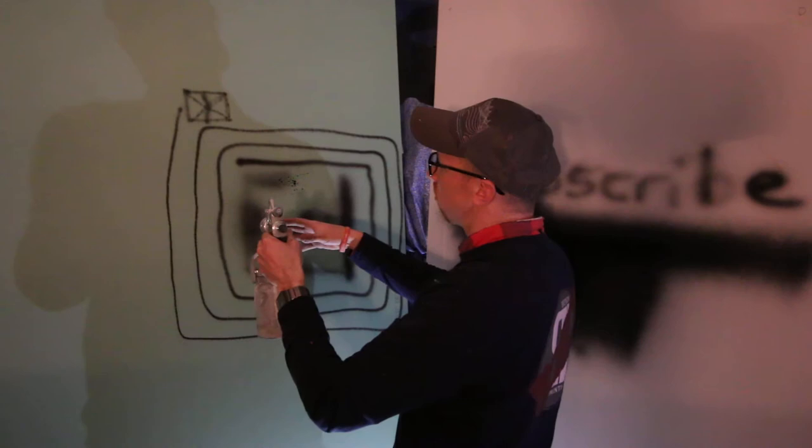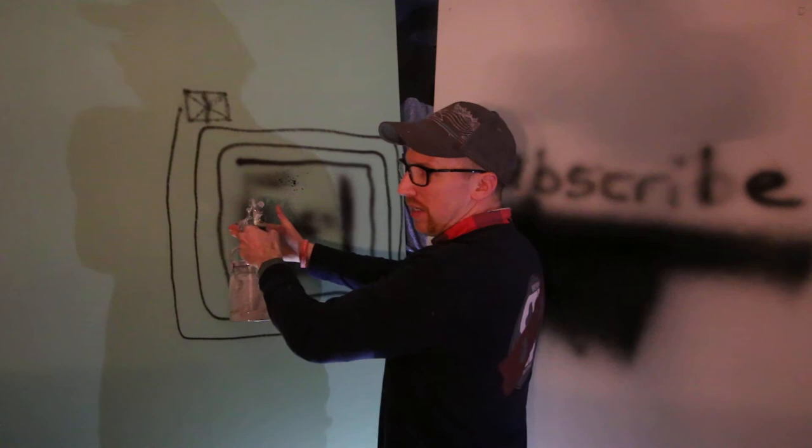And also, instead of that 6 to 12 inch radius that you're working from, you're going to want to be anywhere from 1 to 9 inches with your HVLP. Typically you're about 6 inches when you're running one of these. And like I said, it's not meant for your whole house, it's not meant for your walls. This is meant for your detail stuff, your doors. Lay those doors out really nice, make them look like they're glassed.